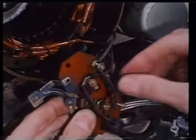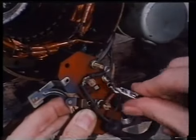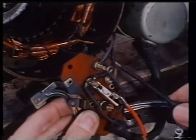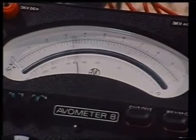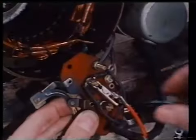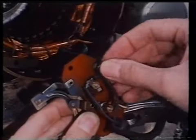Then disconnect the starting capacitor, connected to a multimeter set to read resistance. A gradual charging of the capacitor will occur if it's in good order. Discharge the capacitor before reconnecting.